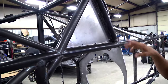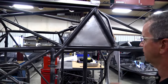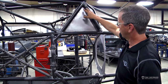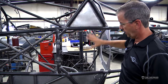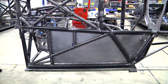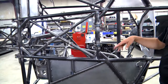These stiffeners come in a long strip and we actually send them out — you can have us break them into the 90 or just throw them in your brake and do that yourself. You just cut them to length, fit them in the corners, tack them in, drill your holes, weld them up, and you're done. It works perfectly — it will keep that fatigue from those welds and make that floor last a lot longer than without it.